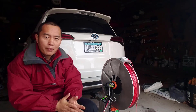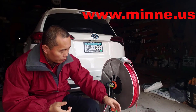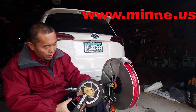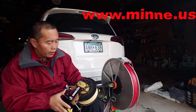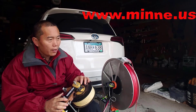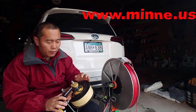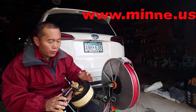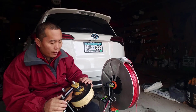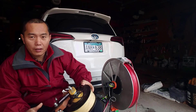Okay, let's go back on the topic. What will be the best tension control? The very common one is the hydraulic tension control. Like my mini machine, this is the hydraulic tension control right here. Pretty much all your car brakes are hydraulic — it's the same thing with this. It's very commonly found on the market, very easy to find. The downside with hydraulic tension control is you actually have maintenance. Over time you have to change the rotor, change the brake — you definitely require maintenance, because the parts actually touch each other when they do the tension. That's hydraulic tension control.